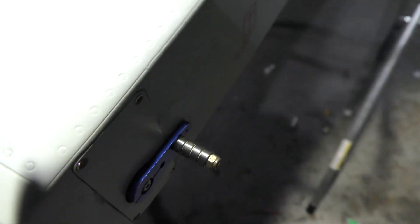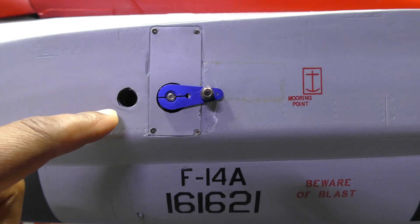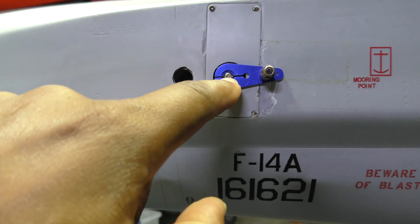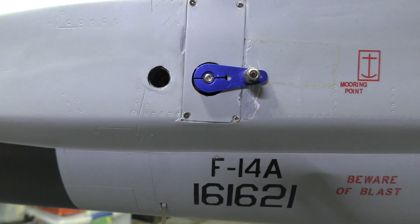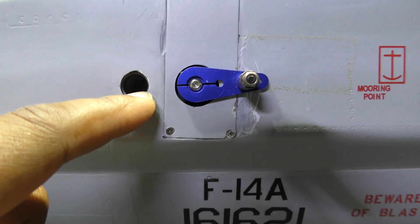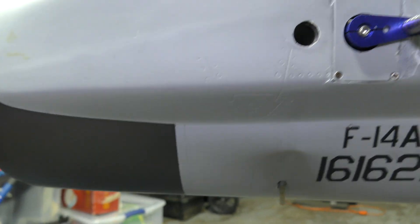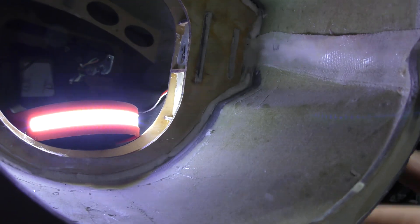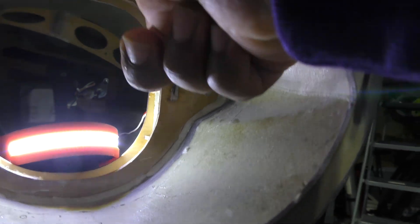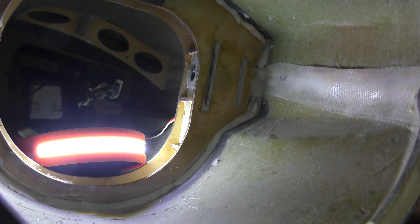It is extremely tight in there. In terms of horizontal alignment, it looks like the person that initially built this did a good job - the center lines are properly aligned. The only thing I needed to do was add some dry lube to these bearings, both the outside and inside bearing, and a little bit in the top and bottom portions of that locking mechanism you can see moving - right here and right there - just to make the movement more fluid.